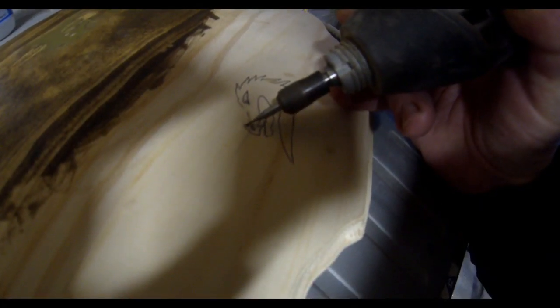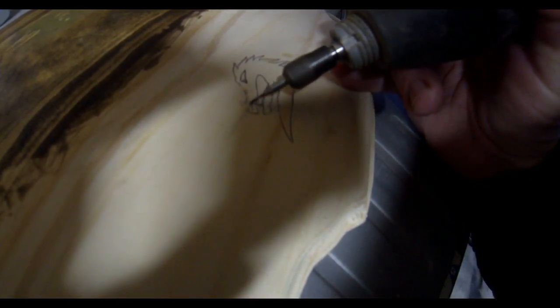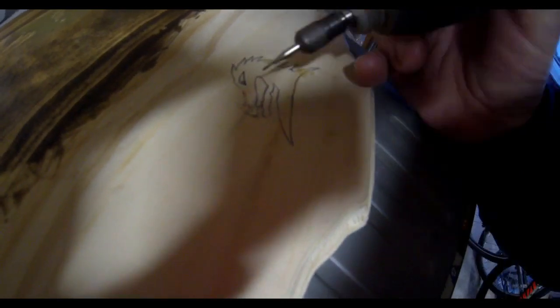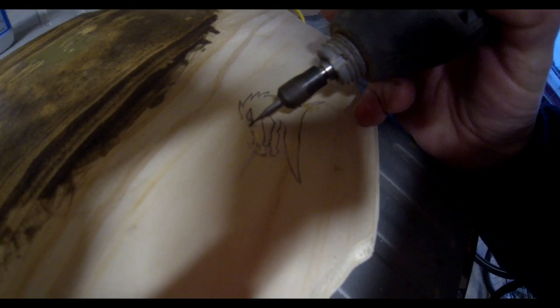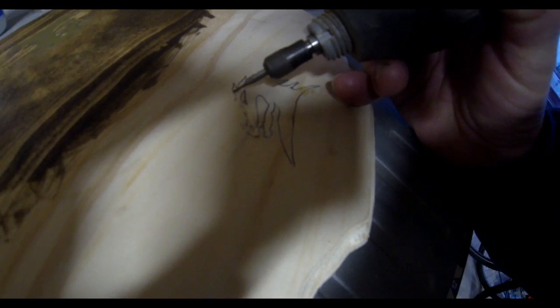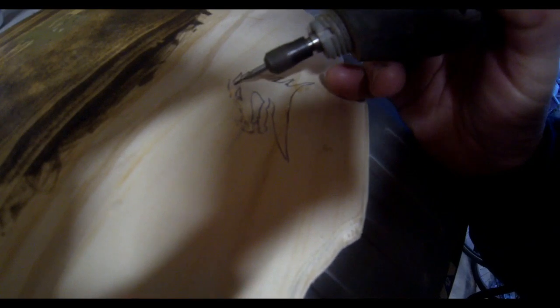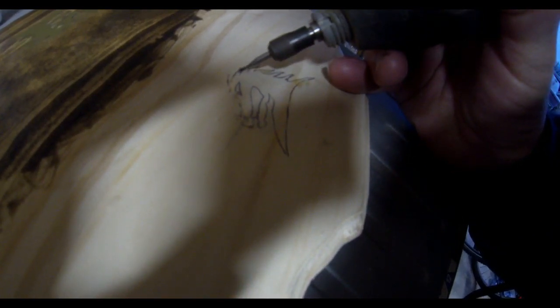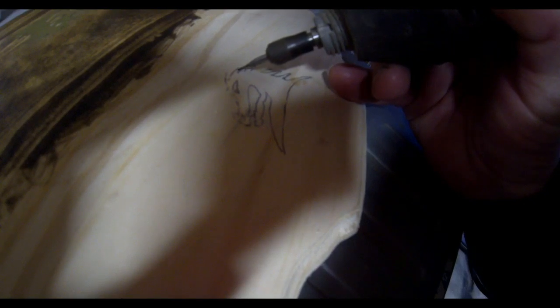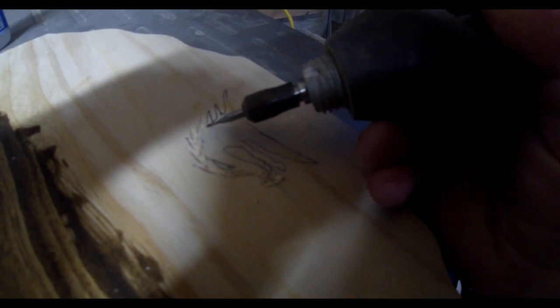For the third and the last inlay project, I did something a little bit different, and this ended up being my favorite. I used that same 1/16 diameter router bit in the Dremel tool, but instead of using that sheetrock cutting adapter, I'm just freehanding it, and I'm using the edge of that router bit rather than coming straight down on the piece. That allows me to get a nice sharp edge, and I could basically just freehand and cut out the entire outside shape. Now on this one, I did not glue the paper down.